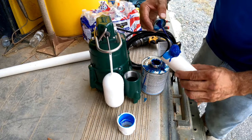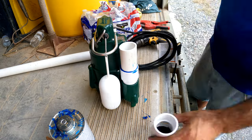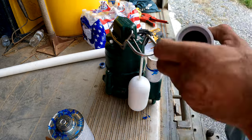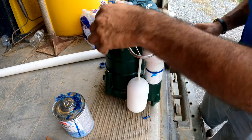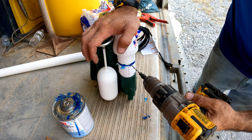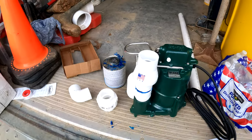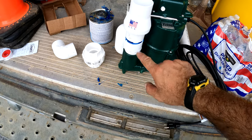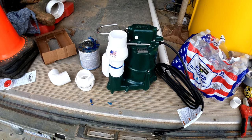I always try to set the pump up before we get it in the basin, so it's easier to work on the back of the truck — getting that male adapter and check valve installed. Then we can drop it in the basin and finish plumbing it. The manufacturer calls for a hole to be drilled right before the check valve so any air that gets in there can get out. Now this thing is ready to carry down to the basin.